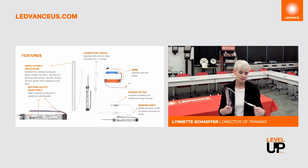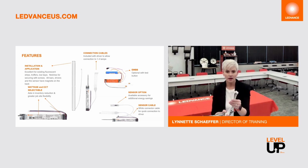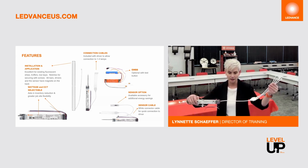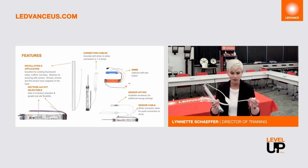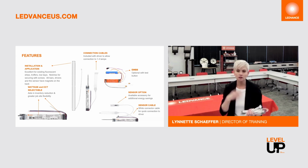The other thing that's nice is that there are connection cables included with the driver. It comes exactly like you see here. This allows for a quick connection for a 1 lamp, 2 lamp, 3 lamp, or 4 lamp situation. There's also a cable harness, which are these little guys right here, that allows you to easily plug it in to make your connection. No wiring required and no electrician required either. So anybody can really do this. There's also an optional EMBB, which comes with a test button too, and there's also a quick connect on that too.